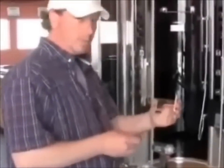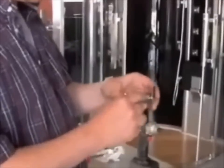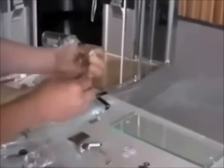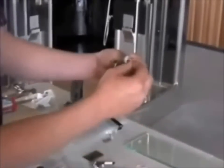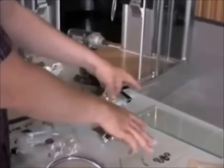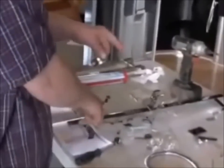For the soap tray, get your mounting fitting with a set screw and loosen that set screw off. There's a little plate and then the mounting bracket. To do the mounting bracket, set the screw through — hardware comes with it — and you've got your gasket. That's going to go up against the glass on the other side. Put a washer and then a nut. Note that you also get extra hardware with the soap tray: two extra screws, nuts, and washers for mounting the handheld shower rod.